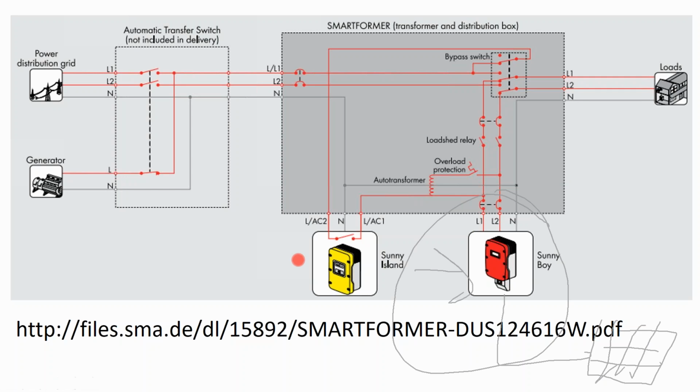And the reason is you don't need your solar inverter and your battery inverter to be of the same brand. The same grid protections that are built into your grid-protected inverters will shut down the inverter during a power outage. If you take that with a battery and a battery inverter and you have a transfer switch, so that this will be an off-grid array when there's a power outage, the danger is that if your batteries are full and your solar's at full power, potentially you could be backfeeding the batteries over voltage and damaging them.